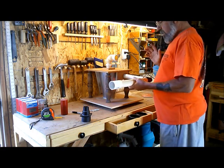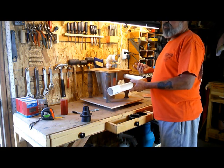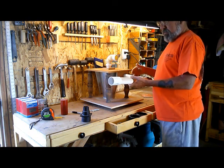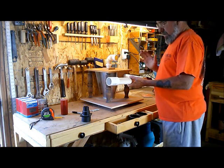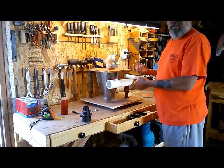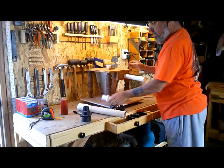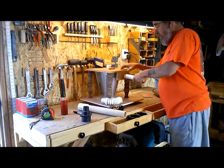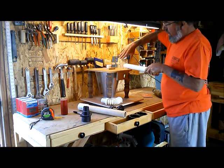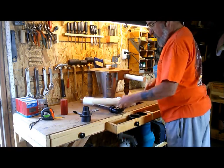I've got all my pieces cut to size and already dry fitted. The only problem I may regret is this 90-degree elbow, because from what I've read about dust collection systems, smooth flow is preferred. I could have put several 45s, two 30s, or a gradual elbow, but with PVC once you glue it it's on forever. I wanted this to be able to be taken apart, so all these plumbing parts can be dismantled - that's good for cleaning. Also, I cut the inlet pipe at an angle so when sawdust gets in there it hits the wall and starts slowing down to fall into the collection bucket. I've already used this and it does work, though the 90-degree is going to be a challenge.